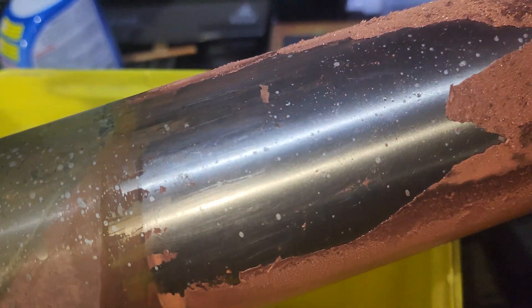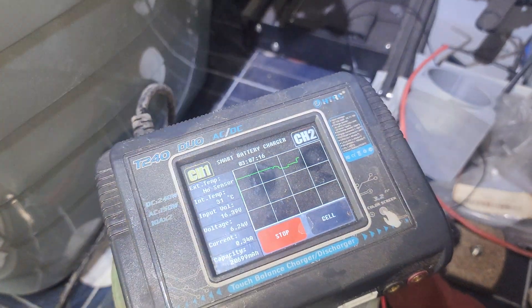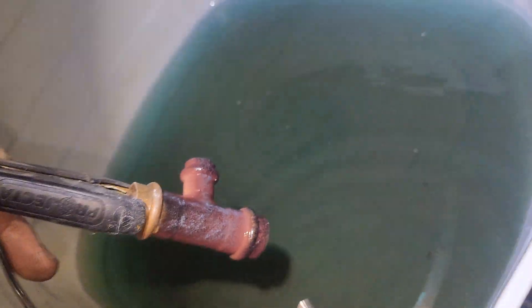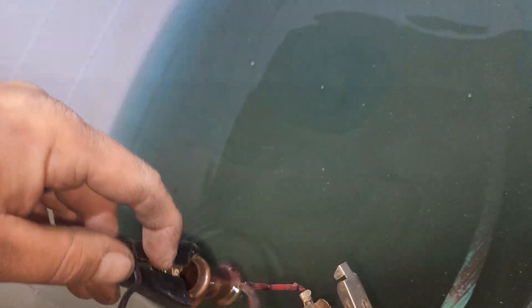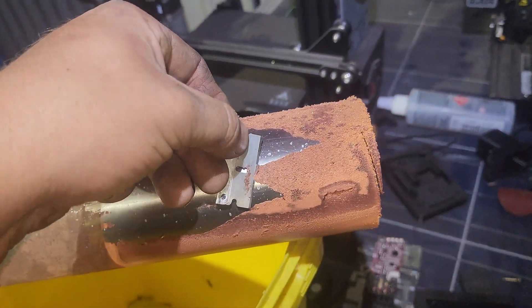Low voltage with a consistent current is definitely the thing. This power supply is no good for that — it turns off. It's got a timeout after 12 or 18 hours or something, it just stops. You've got plenty of blue left in there. I've just got a B-press fitting that's got a damaged O-ring on it, and you can see it's already taking on some fresh copper. The voltage is a bit high for this size fitting because it's getting a bit of a burn — a char to it. If you're getting that black colour build-up, your voltage is too high. You want to keep your voltage down on your cell.